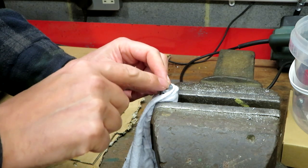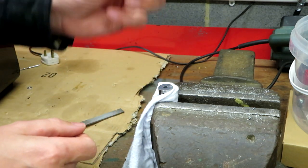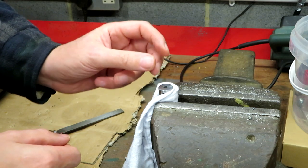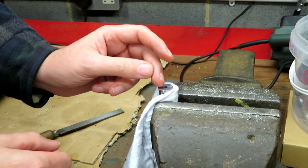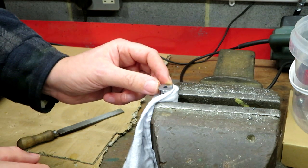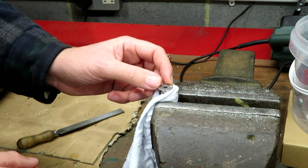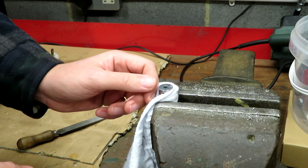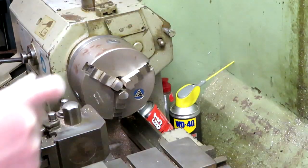What I'm going to have a go at today is I'm going to drill out this hole, put a new piece of metal inside, then try and press that in. Then we're going to drill it out five millimeter again, hopefully keeping the accuracy of the machine so that when we actually drill the hole in the center, I'm hoping it will be in the center this time.